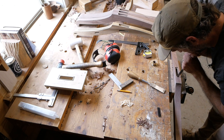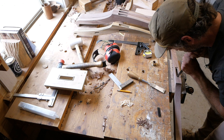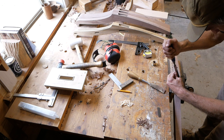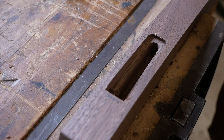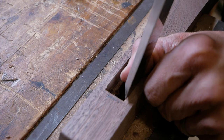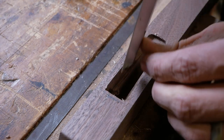It's always good to start cutting the end grain — across the grain, I should say — and then cut with the grain. It's not really cutting, you're more splitting the fibers. I like to use a one inch chisel because I've got a lot of blade — I can kind of support it against the opening and just knife it down.